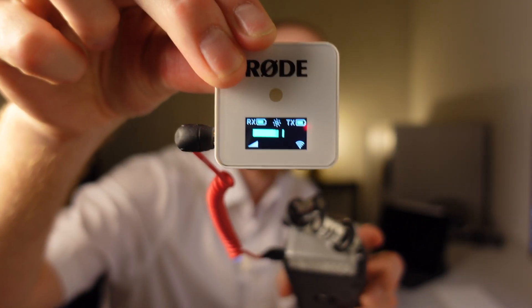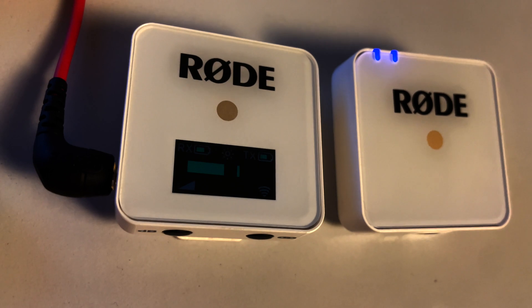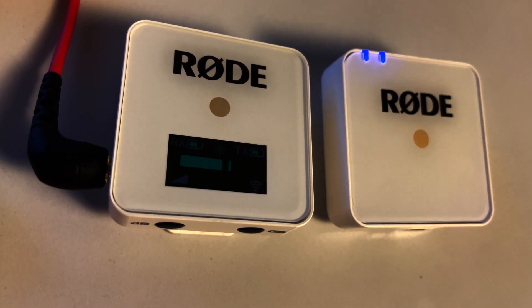If you have a look here, this is the receiver, and the receiver shows you the gain level as well. You can adjust it on the receiver, and on the other hand you can adjust it on the camera or in post. To have a quick understanding of where your levels are, have a look at the Rode but also at your recorder — in this case the Zoom H5. Make sure the levels align and don't go over 0dB, because then you get clipping which sounds bad.